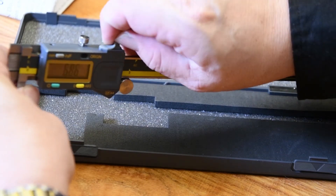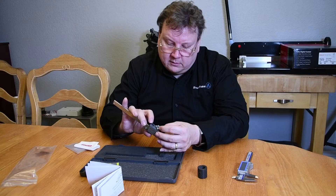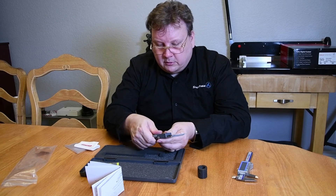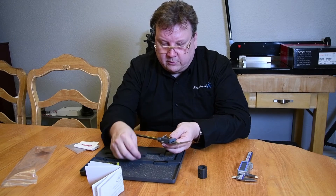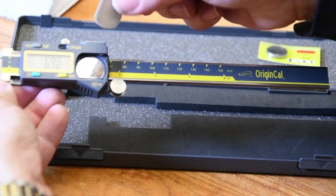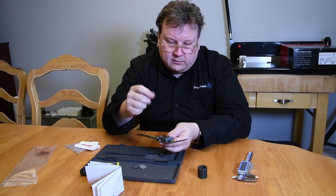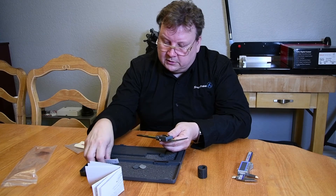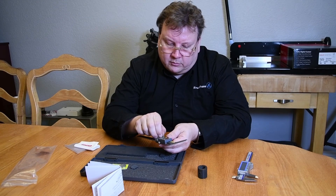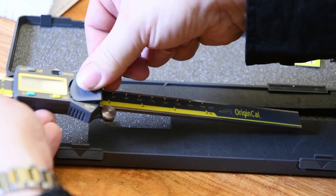This also has an SPC output — you can see that right there. To remove or change the batteries, push down on the cover and push over — push down and out and the cover comes off. You'll see there's a rubber seal inside; don't throw that away, it's to keep moisture out of the battery compartment. There's a tab to pull the battery out. The positive face is upward on these disc batteries. To put it back together, place the rubber seal back in and then push down and slide the cover back on.